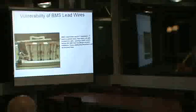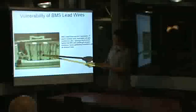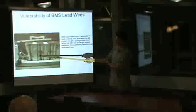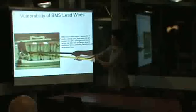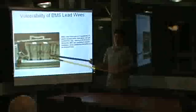It's an interesting problem because it's something that virtually every single lithium battery pack that I've ever opened or taken apart is vulnerable to. So this is a really high quality, well-performing lithium battery, but I open up the casing and you have all these thin wires going right up against this metal can over to the circuitry. Well, this battery is meant to be mounted, so this is the top surface of the battery. And so there's no real pressure between the wires and the metal can.